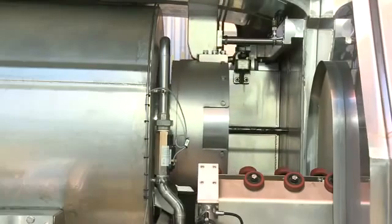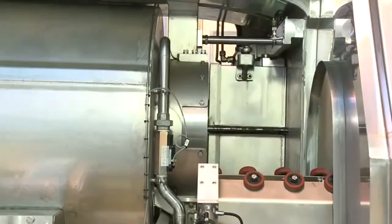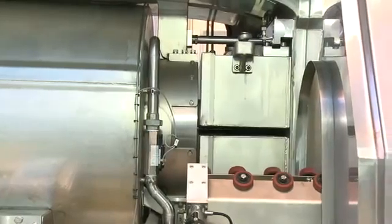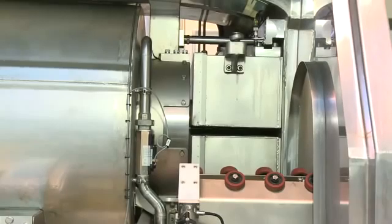As the plugs are moving into the vessel, this is what holds the water in. The vessel will start to fill with water. Once the plugs are in place, the wedge will move into place. The plug and the wedge push against the yoke, and the yoke holds all of these components in place and allows the pressure vessel to reach that ultimate pressure of 87,000 PSI.